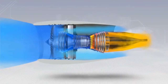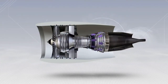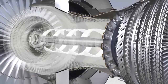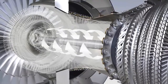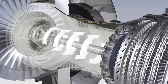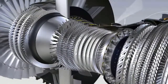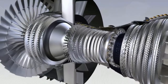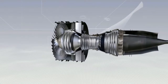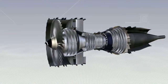Finally, the accumulated energy is extracted in the five turbine stages, immediately after the combustion section. The pressure of the air drops as it passes through the turbines and makes them spin. The turbines, whose shafts ride within one another concentrically, in turn drive the fan and the two compressors. The air is then expelled through the primary duct, joining the air from the fan stream. A turbofan is therefore a flow cycle engine: air is compressed, then heated by burning fuel, after which it passes through the turbines, which drive the compressors and the fan.